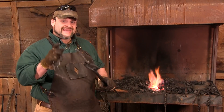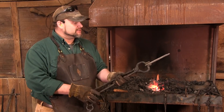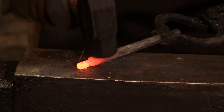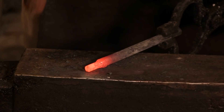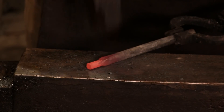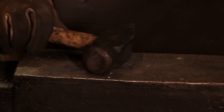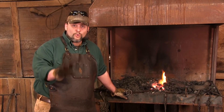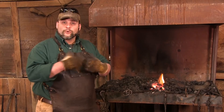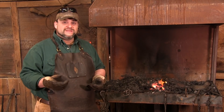Don't forget - that's now high speed steel, an alloy steel on the tip, which means it's going to be a lot more sensitive to heat than the mild steel is. Be careful and don't burn it. I've got a good heat and I'm really just going to baby this whole thing - I'm not going to go nuts on the forging. You will notice a significant difference in what the two metals feel like under the hammer. You'll feel the mild steel give, but then it'll feel like a rock when you hit the high speed steel end - that's okay, that's normal. Take your time, don't get aggressive. The two steels are going to move at different rates when hot, so if you start smashing it you're going to break the weld apart. Baby it, keep it at good heat, don't burn it, work it out slowly.